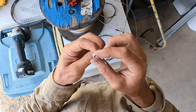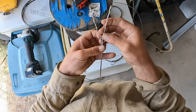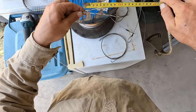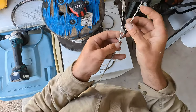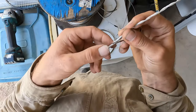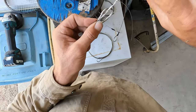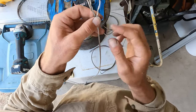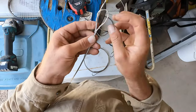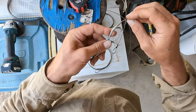There are six strands plus a core in this, so you just leave the core in one. I usually unwrap about 100mm — or about four inches. Now get the one with the core in and bend it over, just past where it matches up with the other. This has a right-hand twist on it, so you always come back and wrap it right-hand, back onto itself, wrapping it around this one. Try not to kink it — if you kink it it won't spiral around.